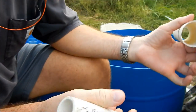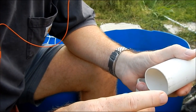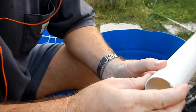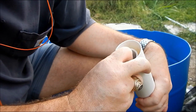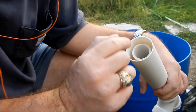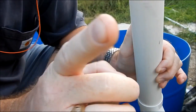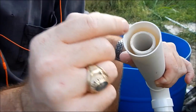This Teflon tape is normally used on threaded pieces, but it does the same trick without threads — it will work in a friction fit situation. It's not ideal, but normally it works well. The goal is to keep this pipe centered. Remember, the only way water can come out is to come in here, go up this pipe, and go out this way. Once you put a cap on this you create a siphon — it works very easily.